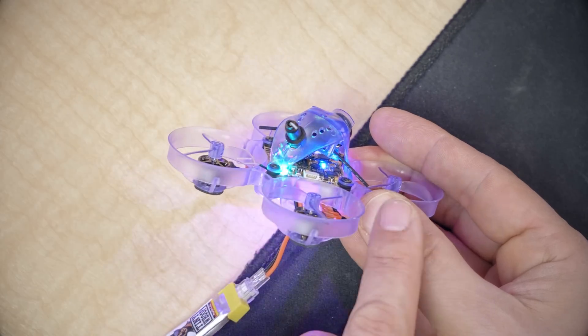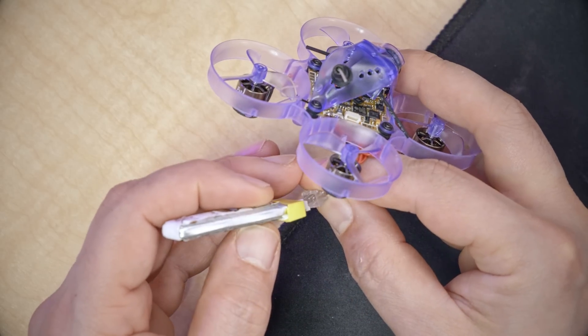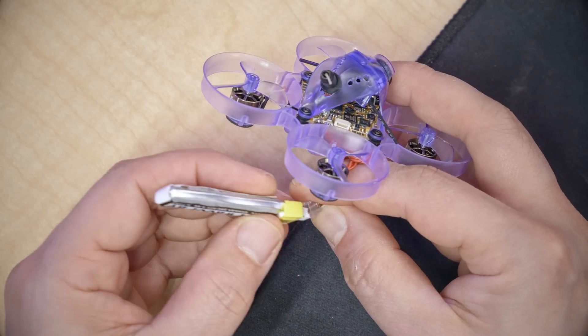Look carefully at the blue LED on the front of the quadcopter — it's going blink, blink. What I'm going to do is plug and unplug power three times quickly, and that's going to put the receiver into binding mode. This works on any ExpressLRS receiver, but it's especially handy for ones without a bind button where you want to bind without flashing. I'm going to look for the very first time it lights up and then unplug, because if you wait too long and go too slowly, this won't work.